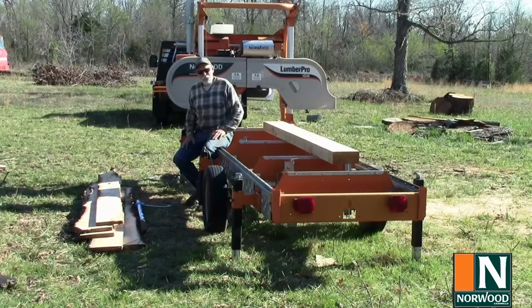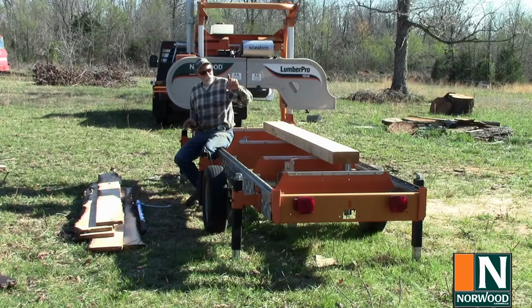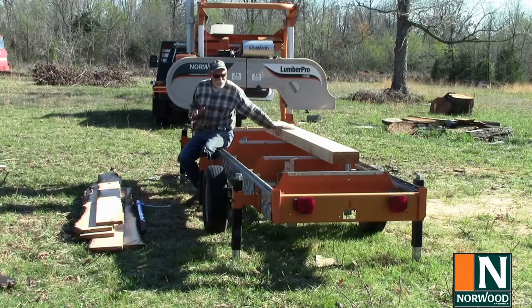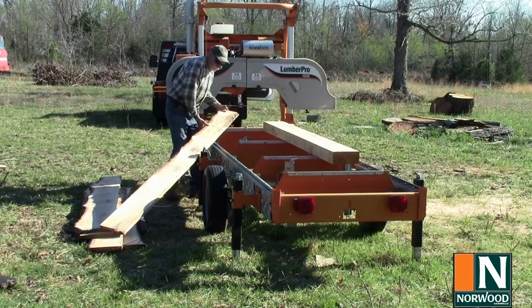But my advice to you would be edge the boards as you get to them. So right now I've got the cant down to 3¾ inches thick. So I'll use that as a backing to hold those boards straight up and down while I edge them. Then I'll come back to my cant, cut it off at 2½ inches, then 1¼ inches. That'll give me my last 3 boards, and I'll be done. We can do about 3 at a time. That seems to work out pretty well.